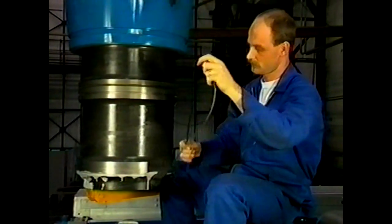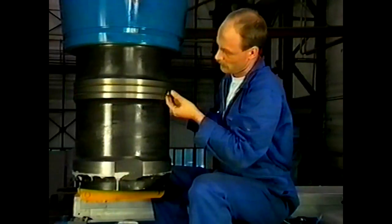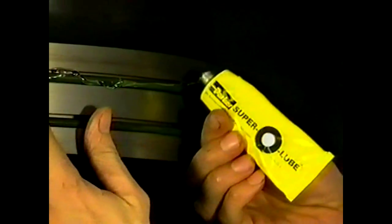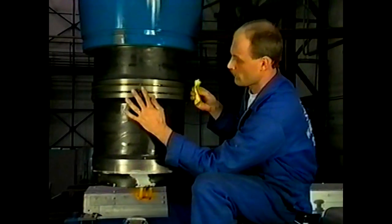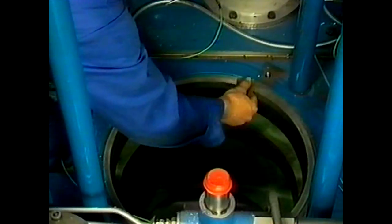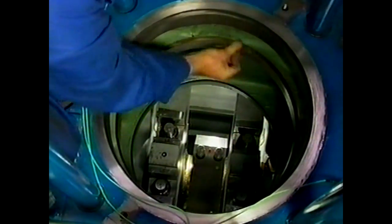To prepare the cylinder liner for assembly, the sealing face must be clean and undamaged. After cleaning the O-ring grooves, always fit new O-rings to seal the engine cooling water space. Lubricate the O-rings with the prescribed grease. If necessary, the edge can be slightly lapped using a special lapping ring. Also remove dirt and corrosion from the central bore using abrasive paper and check for any damage. At the very least, cover the lube oil ducts in the big end bearing cap during this cleaning job.